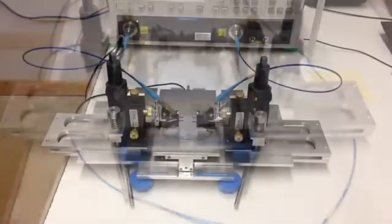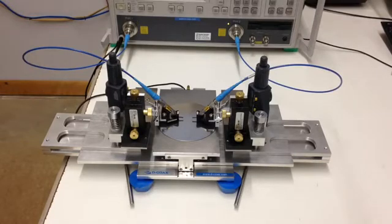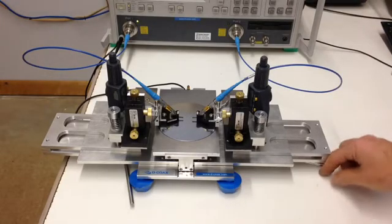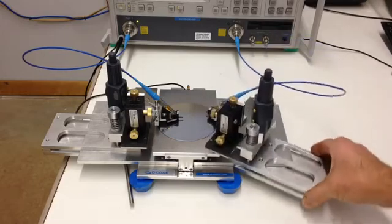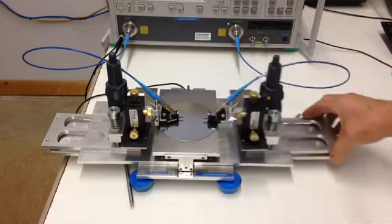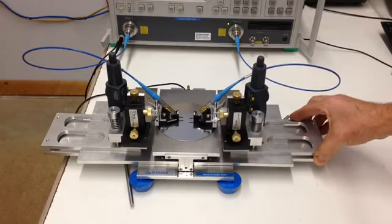That's it for now. Here we are again with the probe station, the 4" by 6.5" probe station with a couple of wafer probes connected to some adapters going to some 1.85 65 gigahertz cables. These cables are 2 feet long. The reason is so that these cables don't undergo any undue stresses and they can reach everywhere quite easily.